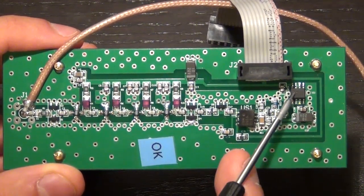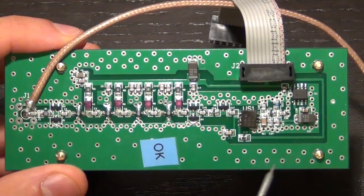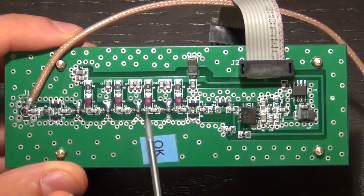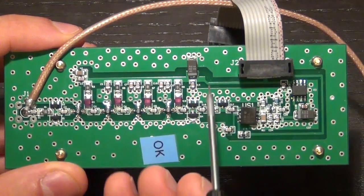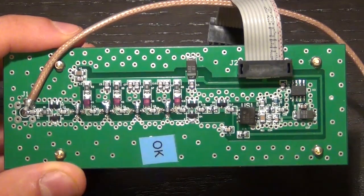And there is another IC here, which is a voltage regulator, and a whole bunch of passives to support that. But there's some other really interesting things here to look at. There's some basic decoupling caps here and here, of course. But if you take a look here, each of these microwave components is going to require VDD. Now, how do we bring VDD to this? Well, the easiest way to do it would be to just bring the VDD line from here and have the VDD line all the way up to here and connect it to each of these ICs.